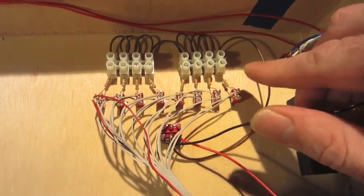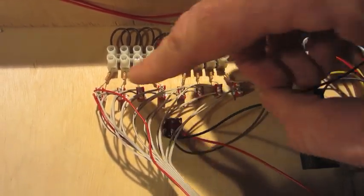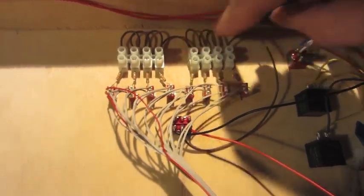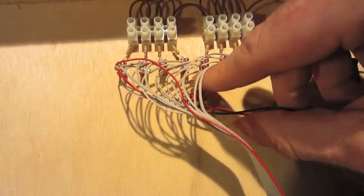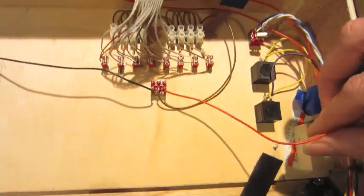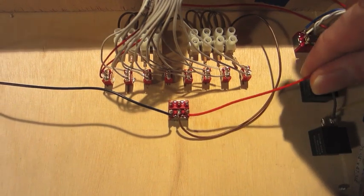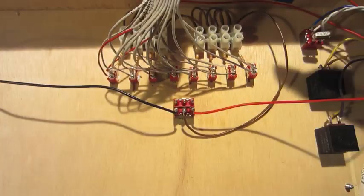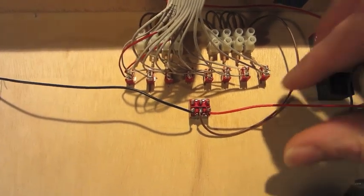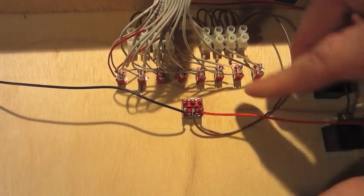In the off position, it sends it through a resistor, which basically these just all route together. These just keep it neat, which then routes it to a toggle switch. This toggle switch can then select between 5 volts and ground, so either high or low state. To keep the keyboard from crashing, since that's how the chip is being programmed, high and low.